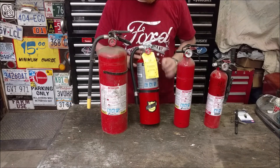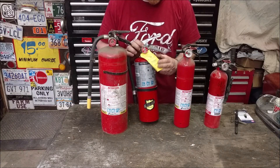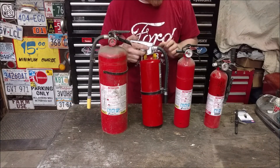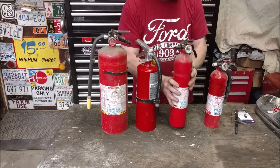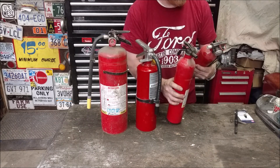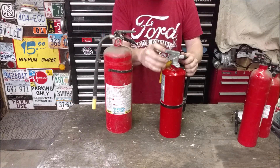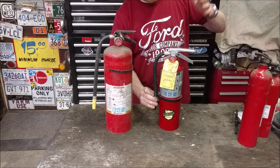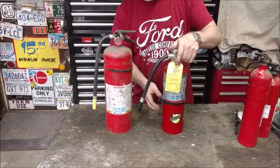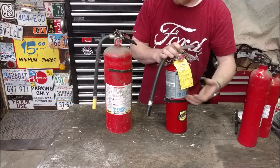This is a small commercial unit, something you can actually get retested. At a business it would hang on the wall or in a glass case and would need to be certified every year. These are more heavy-duty with industrial metal valves versus the little disposable units. This big full-size unit still has pressure, but this one here has lost its pressure — I let a little out — but it's still full of powder and everything else. We need to drain it, flush it out, blow it out, and look at putting a valve in and filling it up with air.